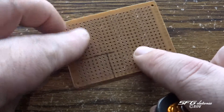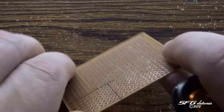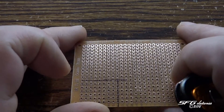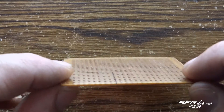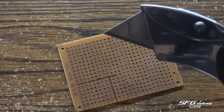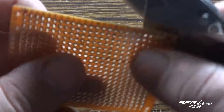So I got my board marked. I've tried cutting it with scissors, tin snips, wire cutters, and side cutters. These are really cheap boards — the listing said pressed paper with some kind of coating to keep it from burning. What happens is these kind of shatter when you put any kind of force like that on them. But I found what works best is just a straight-up utility knife blade. Pull it across, and after you do that a few times, then we'll have our board.